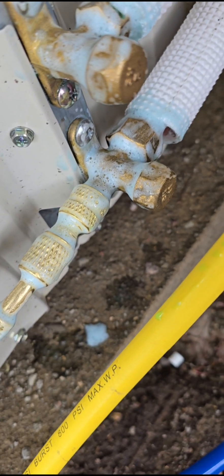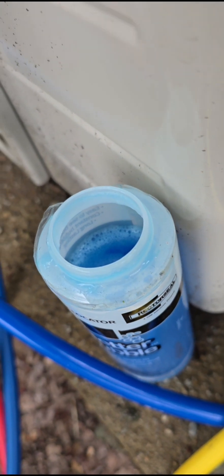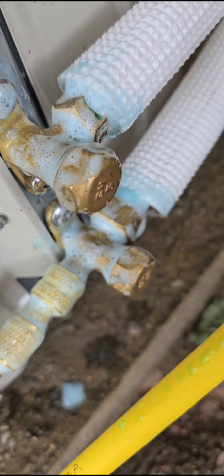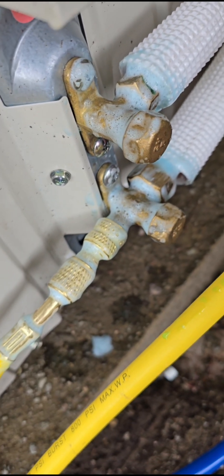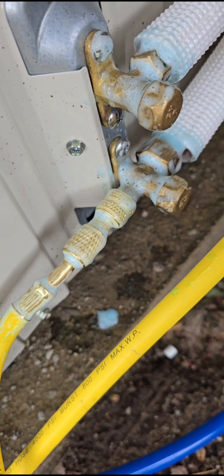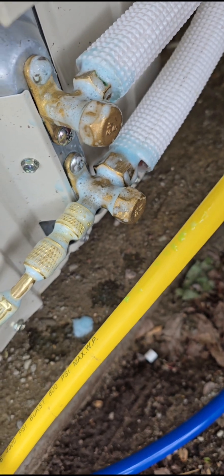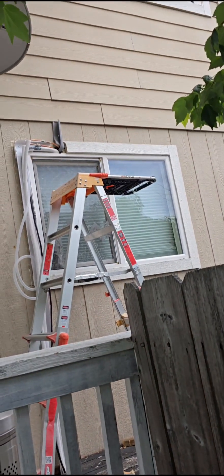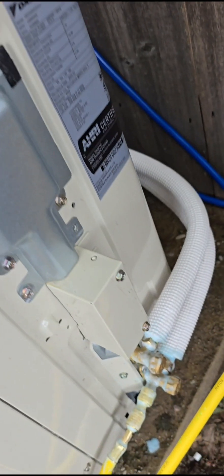It's a perfect product — you barely use any. I've seen people go through whole bottles of this stuff, which means they're not doing it right. With this method, you cover every seam so that if anything tries to leak out, it would have to force its way through those bubbles and would be instantly noticeable — it builds up like a mushroom cloud. So anyway, no leaks anywhere. I wouldn't check that because you're supposed to leave the line set uncovered, but I also tested there and no leaks. We're all set up.